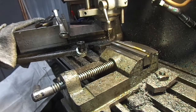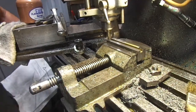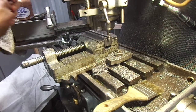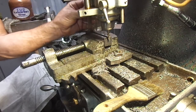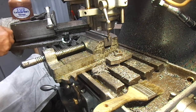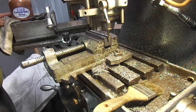So now I got a little bit of charge on the camera, I can go ahead and show you what I've been doing. Well, that's a little bit of difference in the depth there. That says 267. I don't think that's... Oh well, 262.5. Got plenty of room for cleanup, but that'd be 12 thousandths. 12.5. I think I'll be okay with that.